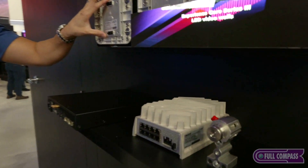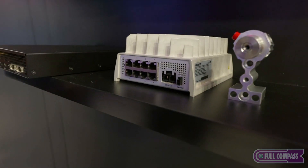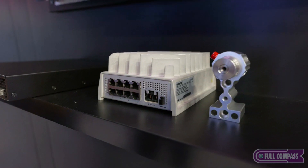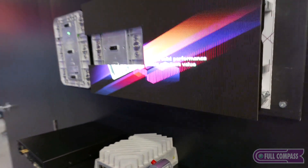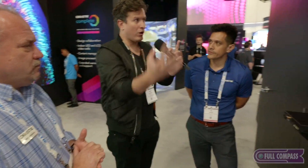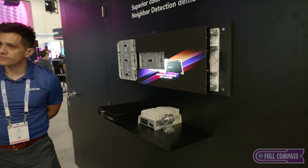This is run by PoE. One of these Octrollers runs eight of these tiles, and the remote power solution lives in a rack off-shelf. You can put it 100 feet away, 200 feet away. So it makes serviceability and reliability a one-stop shop. The BTU coming into the room — I don't have to cool it. It can be in an IDF closet 350 feet away. And scalability too, because you could have a wall dedicated, and if you want to expand that later, you can.